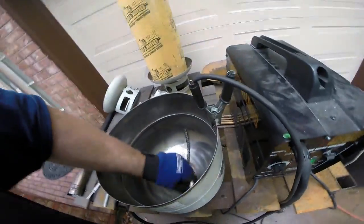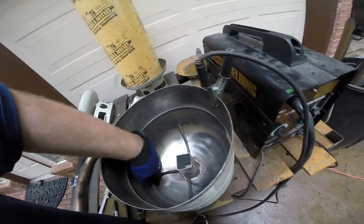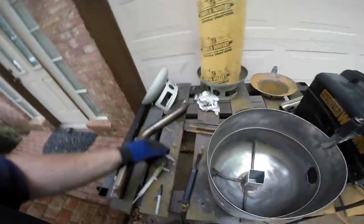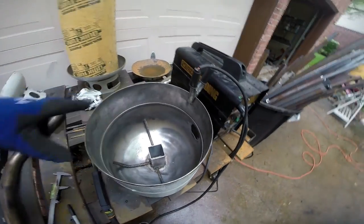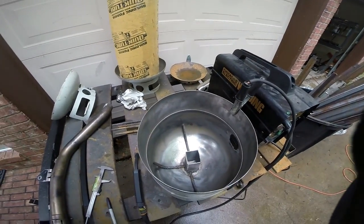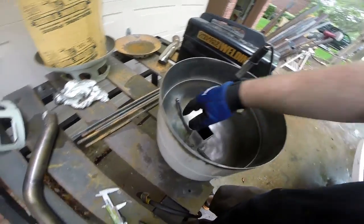In preparation to pour our base level of mortar, I put in these rebar pieces. As you can see, these little rebar pieces will reach up past where the mortar is and help join the side pour to the base. I just took them, put them in a vice, and hammered on them so they bend a little so they're not sticking straight out. These little pieces of rebar are about a dollar fifty each at Home Depot. We're just gonna tack them in — they don't need to be heavily welded because the mortar is gonna hold them in place and they'll help join the mortar pieces. We're not putting one on this side because we've got the pipe coming in, so just three pieces, nice and tacked in.